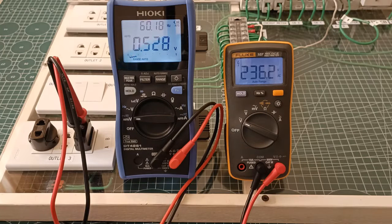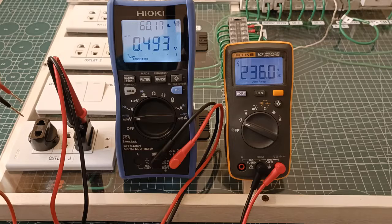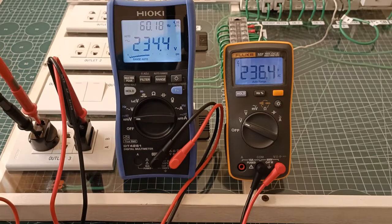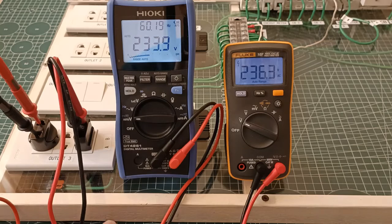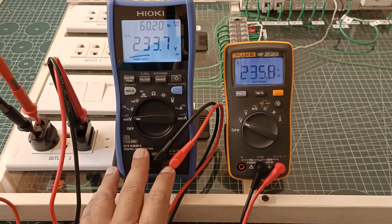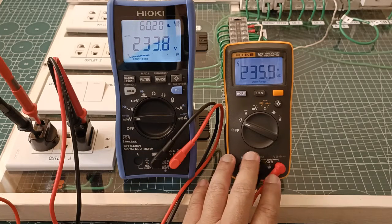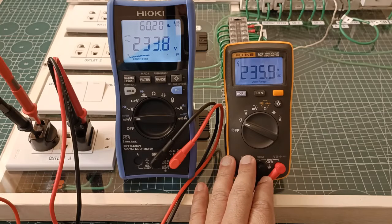But if there are any voltage distortions — for example from harmonics — the resulting AC voltage readings will not be as accurate as the result of a true RMS digital multimeter reading. For those of you who have advanced knowledge on this, all this may seem elementary and obvious, so please bear with me. But there could be those who may have thought that the Fluke 107 may not be as accurate on its AC voltage.